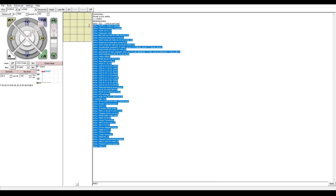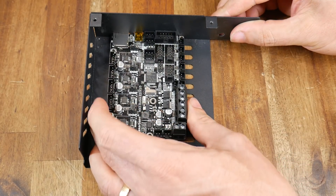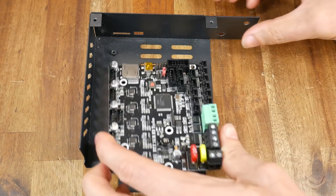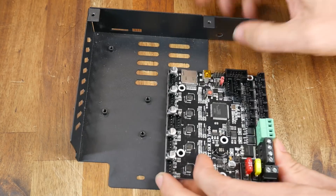Let's get each of these boards installed into an Ender 3 and see what firmware they come with. Before you pull your old printer apart, I'd recommend connecting via terminal, sending M503, and copying and pasting the data for later reference. The Robin E3 is identical in size, so it fits comfortably into the Ender 3 case. The E3 Turbo I was a little bit concerned about, but I was glad to see that it still fit within the standard Ender 3 case without any issues.